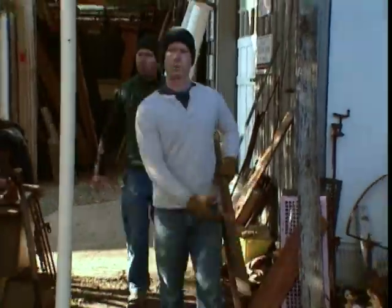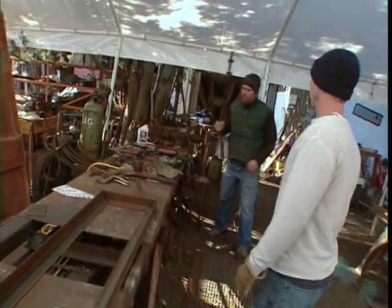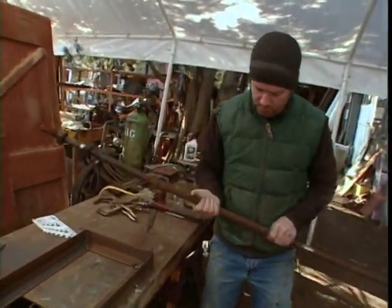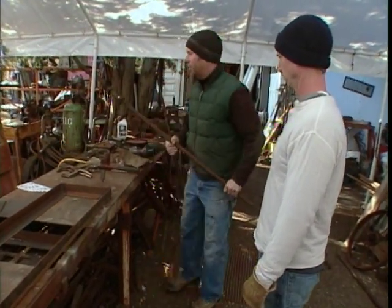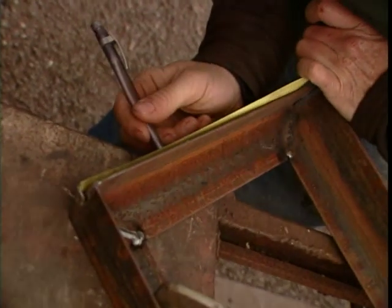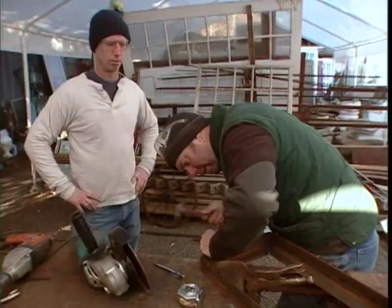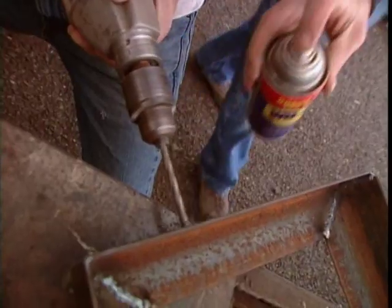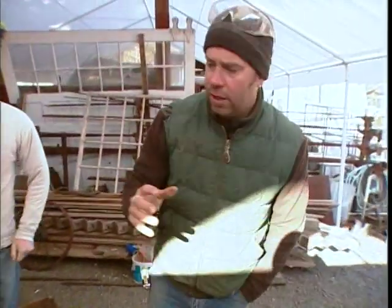This is basically one of the last steps in finishing up the bookcase undercarriage. Our slate chalkboard will sit on top of this. We'll bring our uprights out — the 3x12 pieces of wood — and fold it all together. These little connectors were fabricated using one-inch stock to tie the top and bottom of the wood together. We'll prep the frame for assembly by drilling holes for lag screws, using a center punch to start each hole. A carbide metal bit does the job, with a little oil to lubricate and cool down the drill bit.